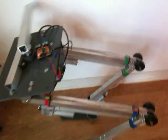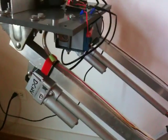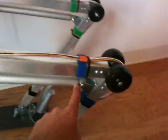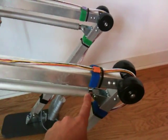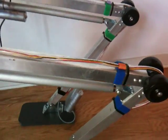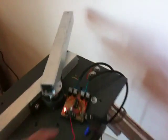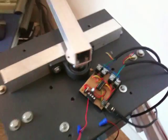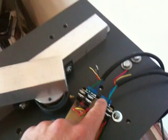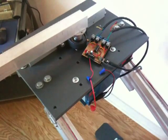What's next is tying in the potentiometers. Each of these actuators has a potentiometer in them so I can read how far it's open and do dead positioning of each of the actuators. The motor controller has inputs for each of the pots — you can actually see the pot leads here — so I'll hook those up.